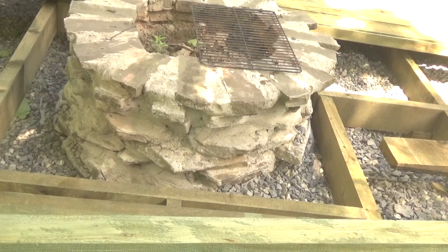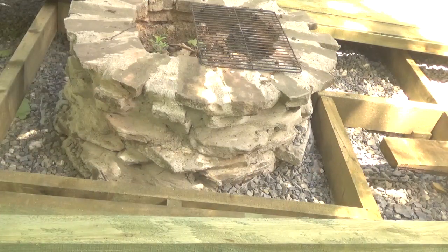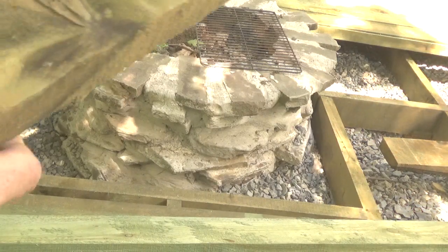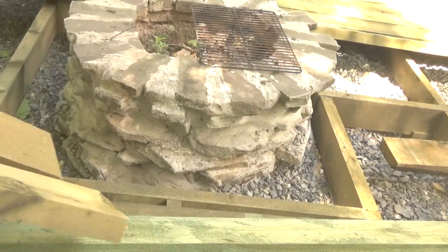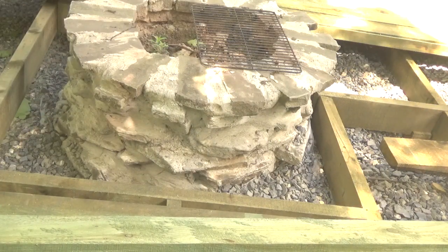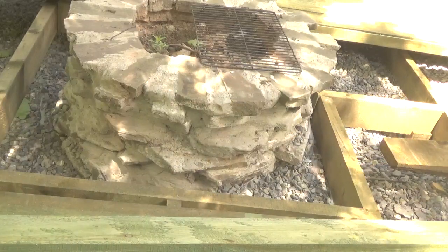Now before I go too far, like with the next board, those 45 degree angle pieces that I want to put in there, I'm going to do that now. And the good thing about waiting, because those pieces are so small, right now I have some leftover boards here, cutoffs, and those will work fine in there. So I'm just going to cut a 45 on both sides, nail them in the corners there, and then my buddy on YouTube who gave me the heads up on that, which I think is a good idea, I fulfilled what I said I would do.